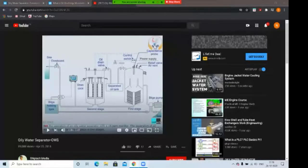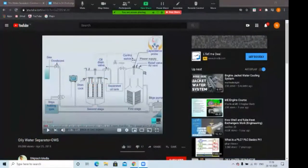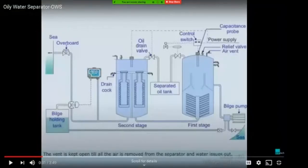And the second question people have asked is about the ones that usually get clogged, so we need to open up, take out these coils, and clean them. And the other thing is the sensors, because as they are sensing the oil, sometimes oil might accumulate on the sensor and it cannot detect or sense accurately. So the sensors are removed, cleaned, and put back again.